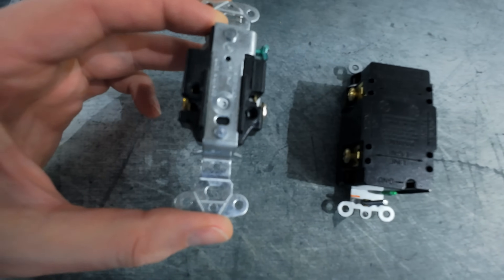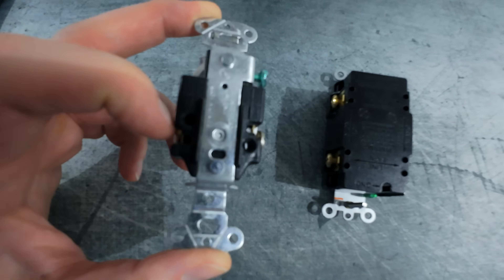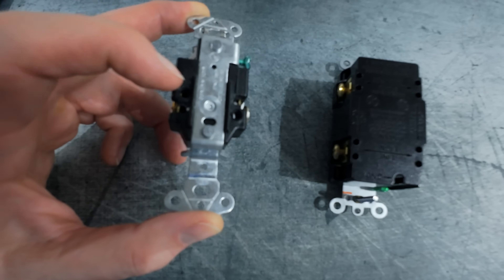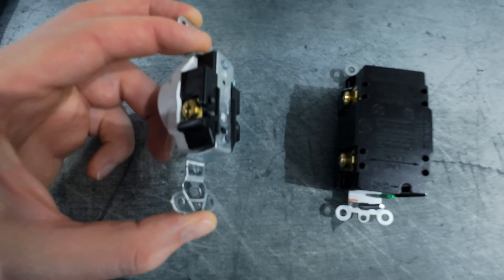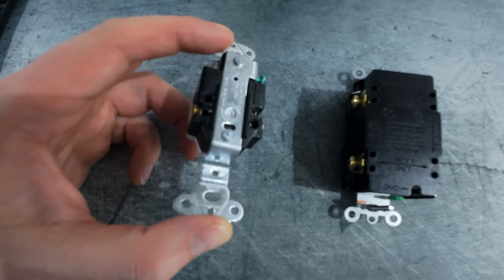With a lot of these, you're going to push in the screw that opens up the little hole. You then push in the appropriate wire into the hole and tighten up the screw until it's nice and firmly grasped within that terminal and doesn't just pop right out.